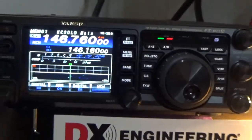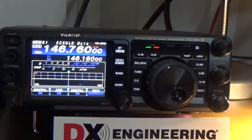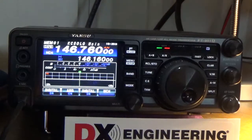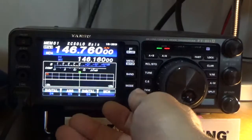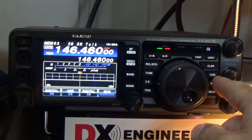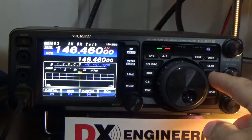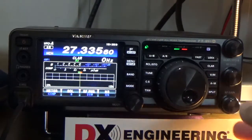So the steps to setting the microphone gain: first we need to go to HF mode. Right now we're in repeater or memory mode, so I'm going to press VM. What VM does is take me from memory mode back to VFO. Notice what happens — now we're in VFO mode and we are transmitting to the dummy load.